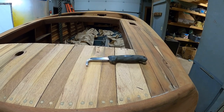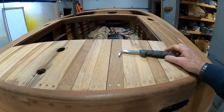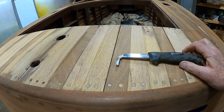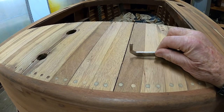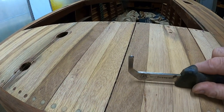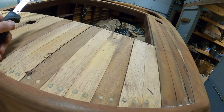We have about half a dozen, maybe ten of these reefing hooks — purchased, I'm pretty sure, from Jamestown. They all come with a blade that's just about the thickness of the shank. Before we lost him way too early, John LaFountain asked me to order a whole series of these so he could customize them. He took each one, put it on a grinder, and ground down the cutting point to various thicknesses — this is the thinnest — and they're just wonderful for cleaning out seams.